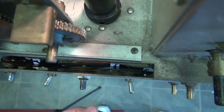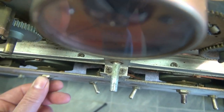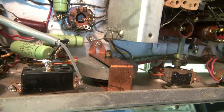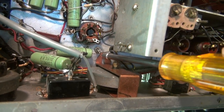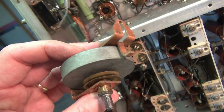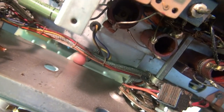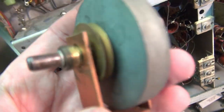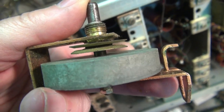The chassis is removed. Next step, I'm going to take these two dials off. There are some set screws hidden behind here, but it doesn't look too bad to get them out. The dials are removed, so now you can see right down the side and see those pulleys — removing them shouldn't be too bad. Removal is pretty much: take off this nut, and on the back side there's a quarter-inch nut. Here's the back side of the band spread pulley — there's that nut. It's a little tricky to get in there. Take it off and that pulley drops out. One thing I noticed when removing it is this little hook — that hook goes down here and supports the wire harness, so you've got to be really careful. The other surprise is yes, this is the right bushing that I have, but it appears they soldered this one in place. This is going to be a little bit of a challenge.